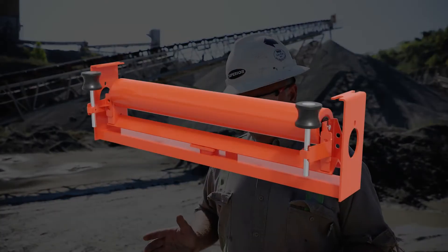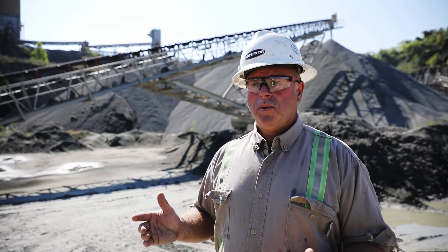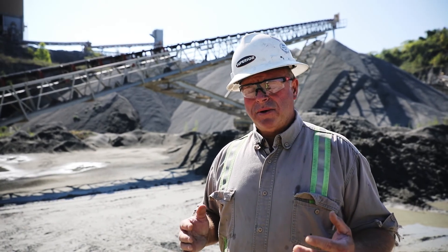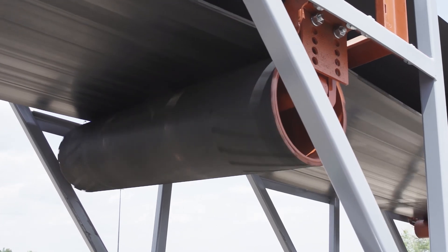As far as training of the belt, we do offer training idlers and self-aligning idlers, and those are going to be installed on longer runs of conveyor where tracking may be an issue due to the conveyor being slightly out of line, the belt having a bad splice, or just having some belt damage causing it to track over and then back. By installing a return trainer that will help keep your belt centered up, and the cadillac of the return trainers is our Navigator return trainer.